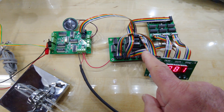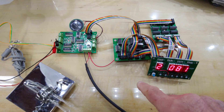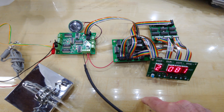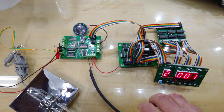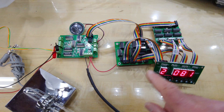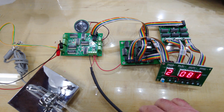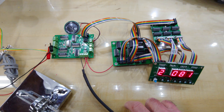This uses 2101, 2102, or 2602 static RAMs in the memory. These static RAMs are 1024 by one bit — not bytes, bit. So if you divide 1024 by eight, you'd have 128 eight-bit words in each static memory chip. These static memories back then were about $25, but they were starting to show up on the surplus market cheaper. Even so, us young kids couldn't afford that.